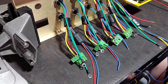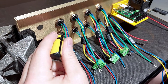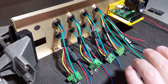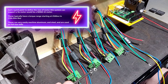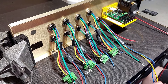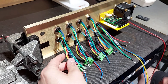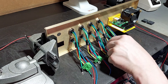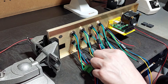I get a lot of questions on lead gauge. For our motors we're using 18-gauge silicone leads along with an 18-gauge ground for our shield drain. For our switches we're using 20-gauge silicone leads and a 20-gauge shield drain. The main reason is that switches have no real voltage and aren't drawing amps, but our motors are — this system can support up to 9-amp motors. Most systems will never use a 9-amp motor unless retrofitting a large Bridgeport or CNC robot, but you still want to pay close attention to proper wire gauge.